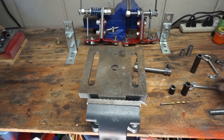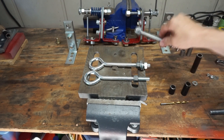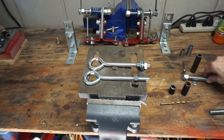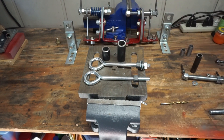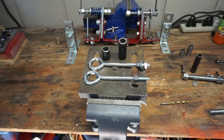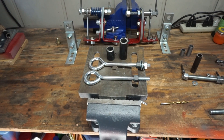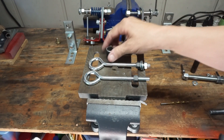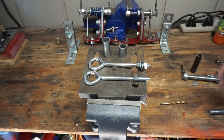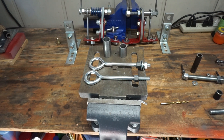So you're going to need to fabricate a couple of eye bolts, possibly fabricate a couple of shaft collars, and get a piece of half-inch nipple pipe cut to two and an eighth or two and a quarter, and the other pretty close to an inch and three-sixteenths. If you really want to get fancy, go ahead and shine them up — it'll look real good. That's pretty much what we need to finish our fabrication. Build those up and let's get on to our next section, which is going to be the assembly of the jig.